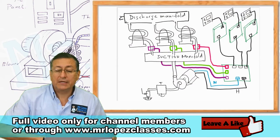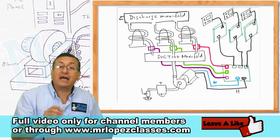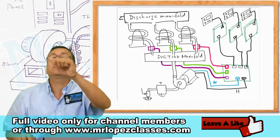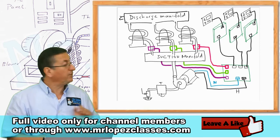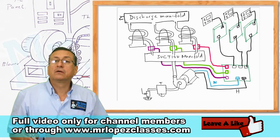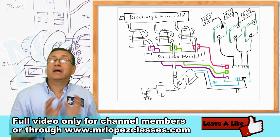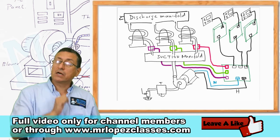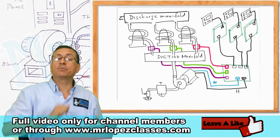This is the picture of the pump relay system. Look at this — I have only one pump. What is the secret? In this video I have three compressors and three evaporators. I need to supply raw water to cool the refrigerant in those three compressors.